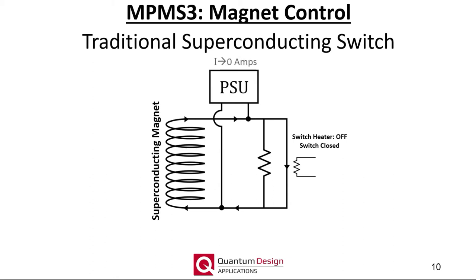At this point, the current supplied by the magnet power supply can be ramped to zero. As long as the magnet windings remain superconducting, the electric current and therefore the magnetic field will, from a practical standpoint, persist indefinitely. In addition to completely eliminating any noise issues from the power supply, being able to reduce the current to zero significantly reduces liquid helium boil off in the case of non-superconducting magnet leads. As the wire constituting the persistent switch must also carry the same current as the superconducting magnet, it has to be thick enough to support several tens of amps, so it can take a significant amount of time — typically tens of seconds — to heat and cool this wire segment to flip the switch. Furthermore, before opening the switch to charge the magnet, the voltage of the power supply must be increased to match the current within the magnet, which takes additional time.